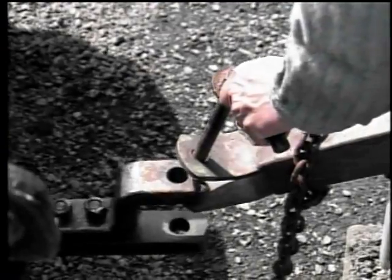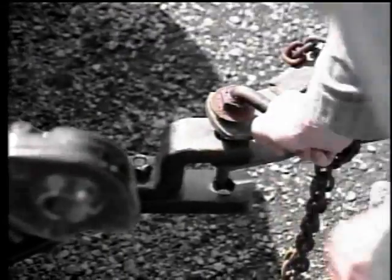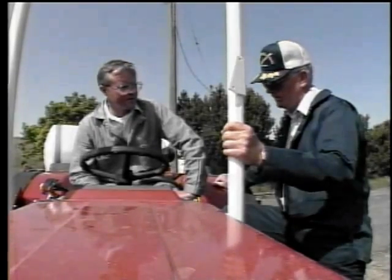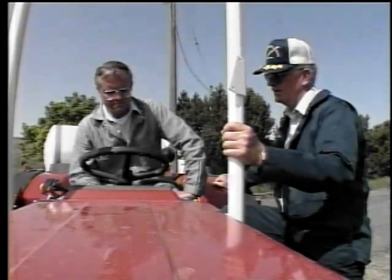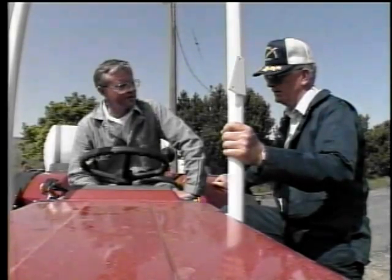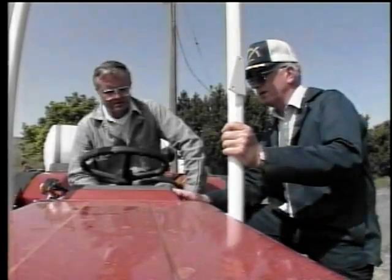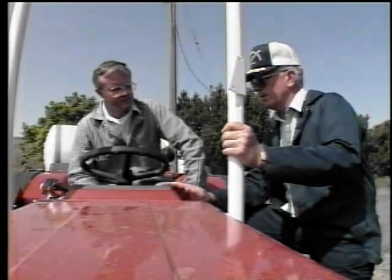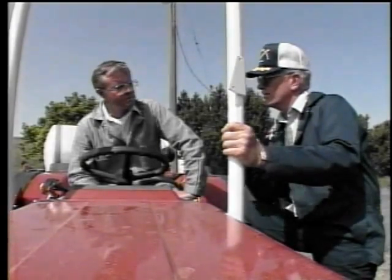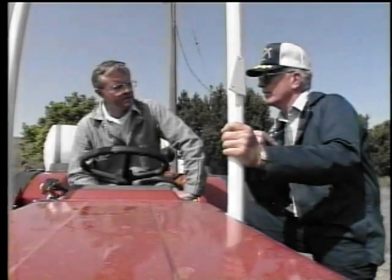Oh. I'm supposed to be going, what, 4 miles an hour, right? Right, Darrell? Right. Okay, well, you give me a few minutes, I'll check out this tractor with the sprayer on it and check the speeds I need to be going to go 4 miles an hour. All right, I'll tell you what. Lots of times these tachs and RPM indicators are not correct. I'll go over and lay out a 200-foot course for you, measure it out, and then you can drive across it, and we'll time it, and we'll know exactly how fast you're going. Okay.